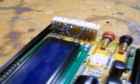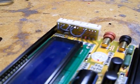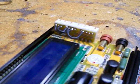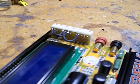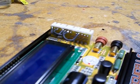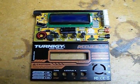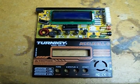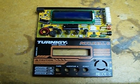I took my voltmeter and checked all the pins with the continuity check, comparing them with the other connectors, and confirmed there were two visible burnt traces — plus a trace on the other side of the PC board I couldn't see. I ended up soldering three jumper wires to restore the connections, tested everything, and it's all working correctly. So if you did something similar and plugged the power wire into the two-cell balance port by accident, maybe this is what happened to your charger — and it's a quick and easy fix. Good luck!